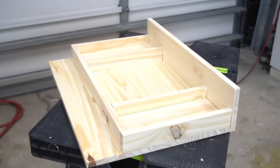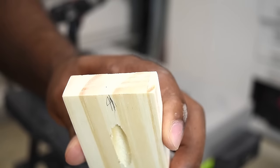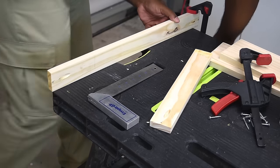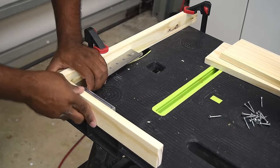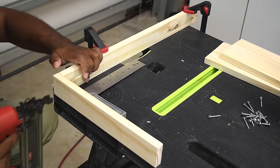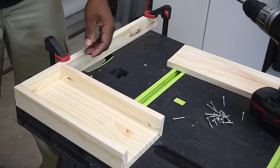This is what the vanity mirror area should look like once it's all assembled. I'm going to use the pocket hole jig to make a few holes at select locations so I can hide them. Although I added pocket holes to the end of this piece of wood, I decided not to use them because I was concerned about the wood splitting when driving screws. Instead I used wood glue and the nail gun. You can also go with dowels or screws with filled heads.